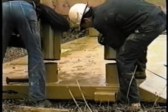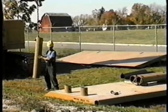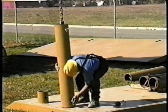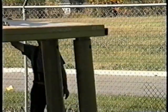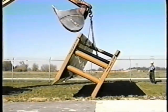They are designed to assemble fast. To assemble your trench shield using an excavator, place your first sidewall on the ground with collars up. Next, lower your spreader pipe over the collars of the first sidewall. Install your spreader pins and insert your keeper pins. Then lower the collars connected to the second sidewall into the vertical spreader pipe of the first sidewall. Install your spreader pins with flathead on top, then insert keeper pins. Your trench shield is now complete.